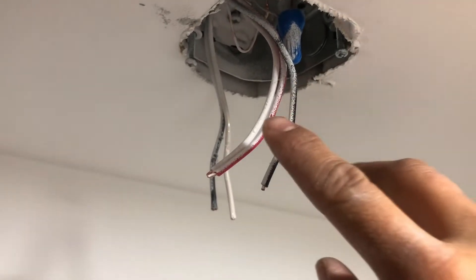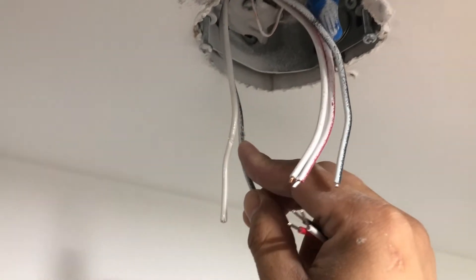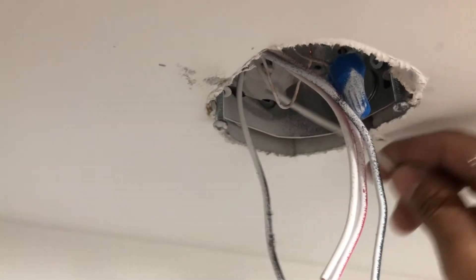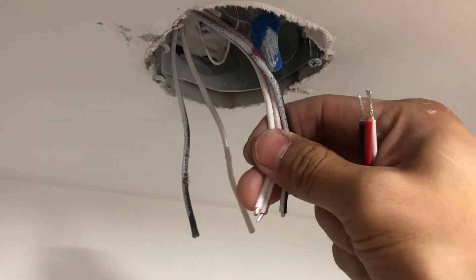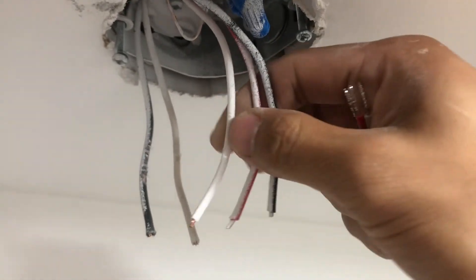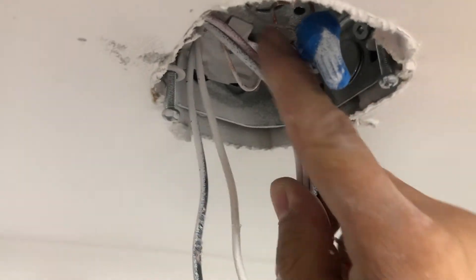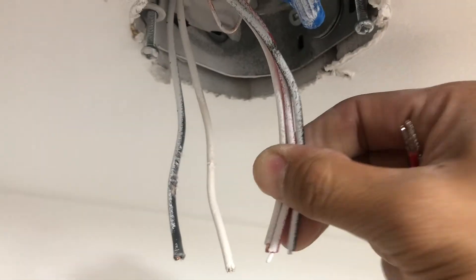This is the first alarm in the circuit. The power wire comes in here — this is the neutral, this is the live wire. It branches off the hallway lights circuit, so if there's a problem with the fuse panel and a breaker trips, you can immediately tell the main lights aren't working, which means the fire alarms aren't working — a built-in indicator. The 14/3 wires are attached to each alarm, syncing the first to the second and second to the third. The 14/3 wire running between units needs to be in armored cable, also painted red so anyone opening walls knows not to cut it.